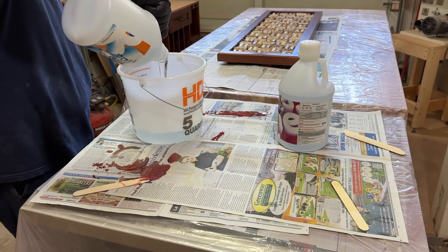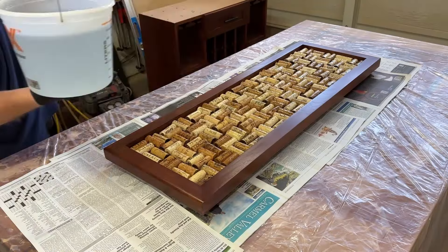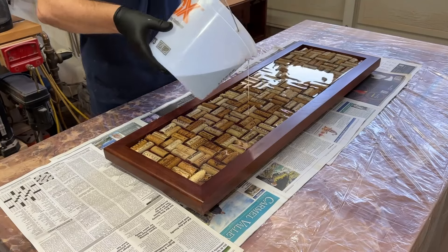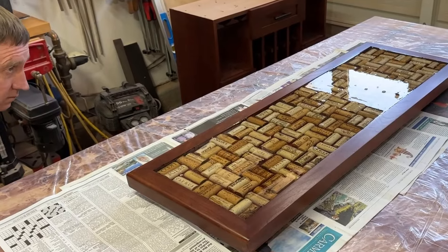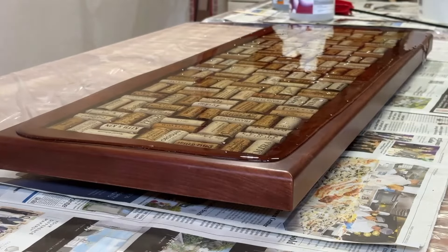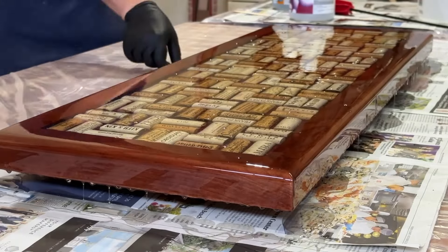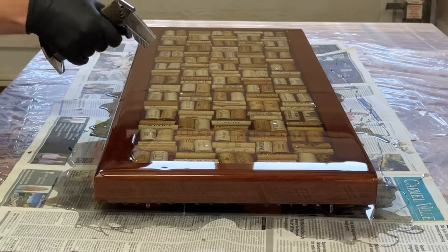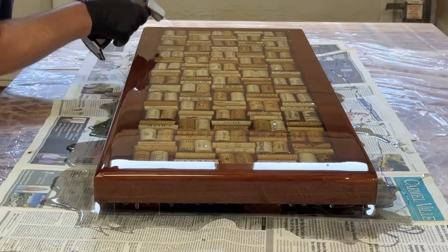It's now about 24 hours after the initial red epoxy pour and about 12 hours after the seal coat over the corks. The deep pour goes great — I stopped at the perfect point, filled to the edge and not overflowing. I should have stopped here, let the deep pour solidify, and then come back the next day with tabletop epoxy. Instead, I thought I'd just let the deep pour spill over the edges, but this was a huge mistake. It looked great initially, but this stuff is just too runny and too slow to set up — it drained around the edges really unevenly by the time it solidified many hours later. Now I've got an ugly mess to deal with.